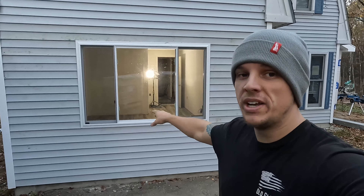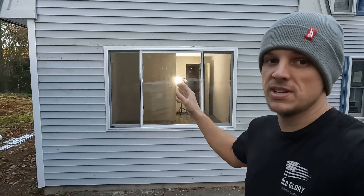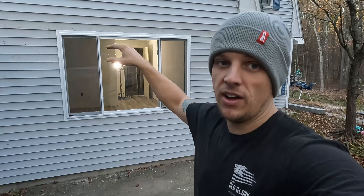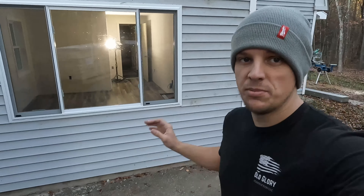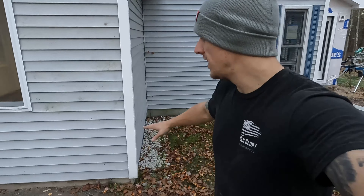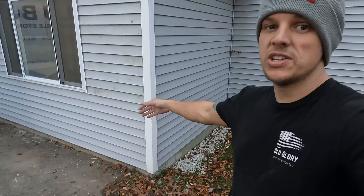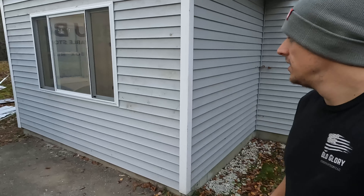So I was recording and I got to a point where I had to connect the new siding — I don't think it's the same brand, but it's like an eighth of an inch shorter. So over five or six pieces it was going short a little bit, so I took it out. You can see the bottom half is brand new and then to the bottom of the window is the original, and that made the spacing doable — I was able to squeeze it out. You can tell a difference here but in person it's really not that different — this is the side of the house and I think it looks pretty good, better than OSB.